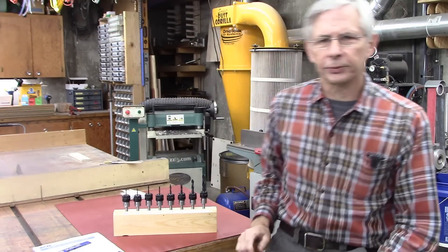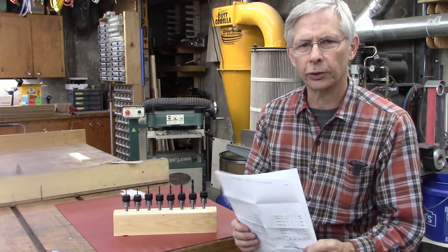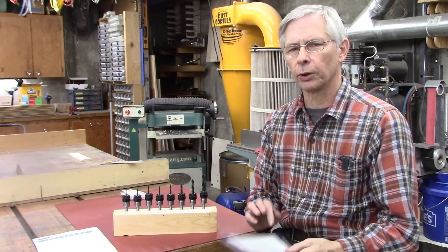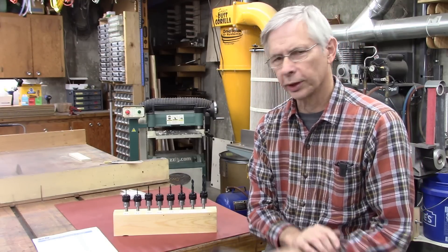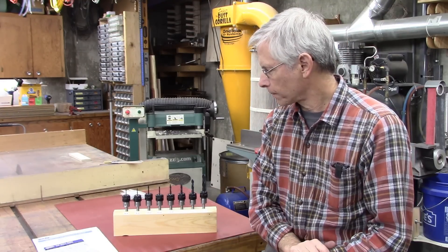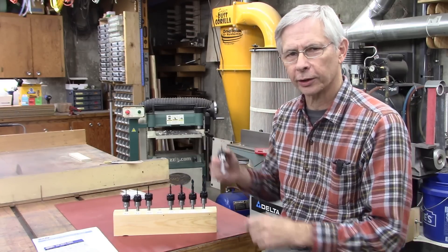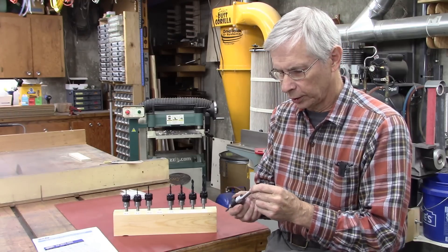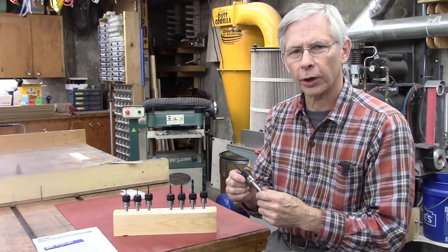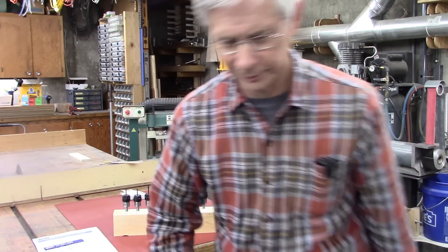Looks like a good thread. Well, that about wraps it up for today. I'll put a link to the thread chart that I went by — it shows what size drills create what percentage threads. The Machinist Handbook says there's no considerable loss until you get below about 60%. Most of these are between 66 and 70. Thread charts like this are generally about 75% thread. I'll put a link to the collets and the collet holders. Hopefully if you've got a metric collet you won't have to turn down the shanks — that was probably the hardest part. Thanks for joining me. Be sure to subscribe and ring that bell. I'll see you next time.